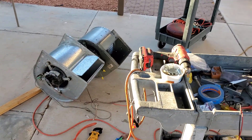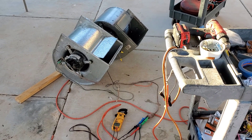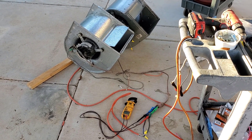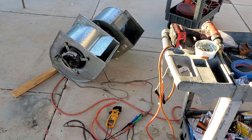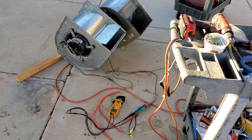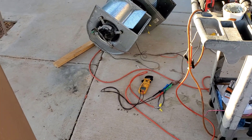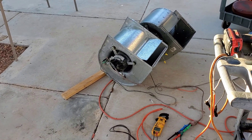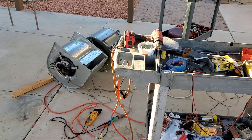There's more tinkering I've been doing. I'm still waiting to see if I can find a used compressor — I really don't want to buy a new one for my project in case it doesn't work as planned. Spending five or six hundred bucks to roll the dice, just to get a scroll... I'd like to go rotary but an R-22 rotary is going to be pretty hard to find. I looked on the Emerson site and it shows that scroll compressors are good to run down to 45 Hertz — the operating range is 45 to 60 Hertz. So if I get a three-and-a-half-ton three-phase scroll compressor, I should be able to slow it down a little bit if I don't have enough power, or if I want to back the capacity off to make it run longer and more continuous. Anyway, we'll just keep playing around with that — I'll catch you guys later.